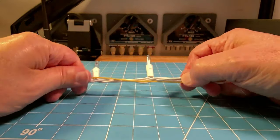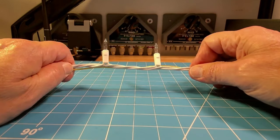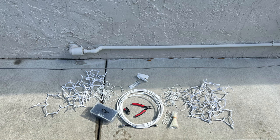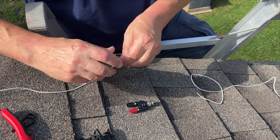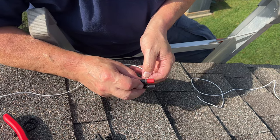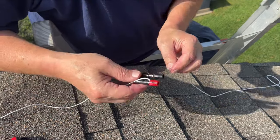If we want this up for the long term, the friction has pretty much left the light bulb, and I'm afraid over time it can pop out. You may need to hit this with a little bit of crazy glue to keep all of these light bulbs in here. You're saying to yourself, 'That's a lot of work, Bob — you know how many lights are on the string?' Well, if you can't get a wire antenna up outside and this would give you the ability to do it because it's completely camouflaged — it looks like holiday lights — a little time with some crazy glue is not that bad of an investment. Collect and organize all your supplies and then install your holiday lights just like you would any other year. Where shingles overlap there's usually a gap where you can push in the clip, and if you need to go over top of a gutter, just reorient the clip. But remember, these are aluminum gutters. I used one of the many online dipole calculators to determine what length to cut this wire to for resonance on 14285, and then I pre-cut it at the workbench.